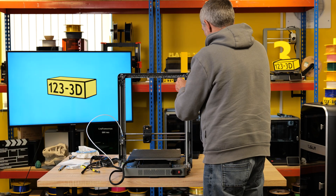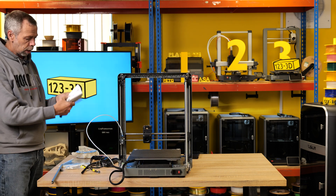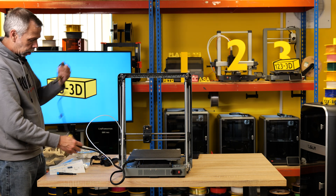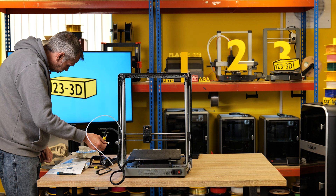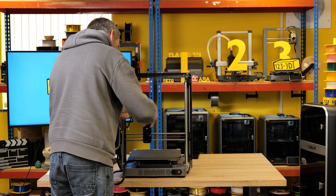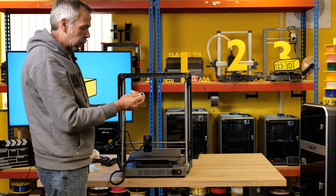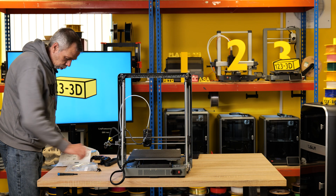Left one — just make sure it's lined up correctly; you don't want to be ramming the screws in and cross-threading anything because that would give you a bad day. The little plastic clip appears to be on the lower portion, so that would indicate we need to go that way down with it sticking out the side of the machine. This cable clips in here, then we have a plug labelled 'D' — D is for detection, referring to the filament runout sensor. And this cable here pops into the top of the extruder — the locking clip faces the back, push that down, make sure it's locked into place.